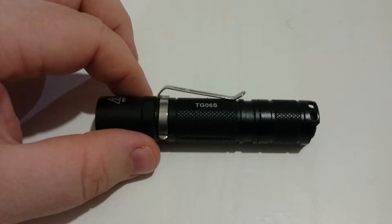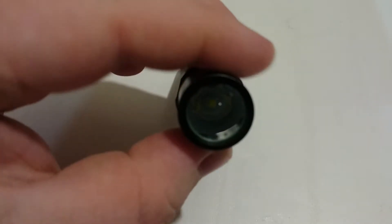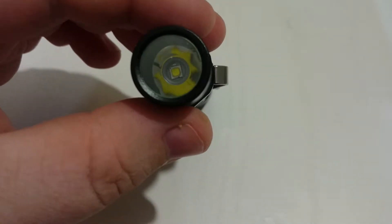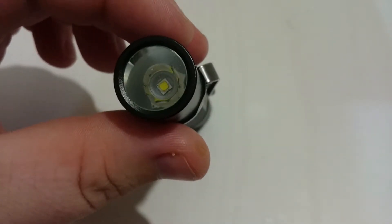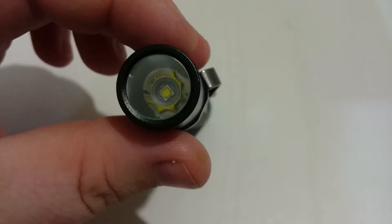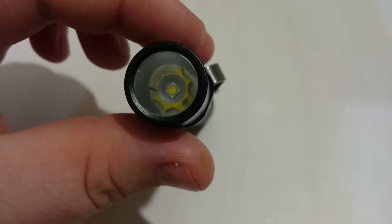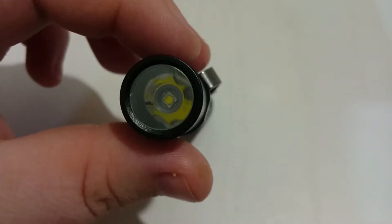Alkalines start to sag at over about 1 amp, whereas a NiMH can happily put out up to about 10 amps. It uses a Cree XPG2 R5. You can see from the phosphor layer that it is fairly colored — it does look fairly yellow. The tint is neutral white on this emitter. It actually seems a little bit warmer than neutral white to my eyes, but when we go outside you guys will see what I mean.